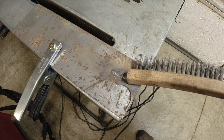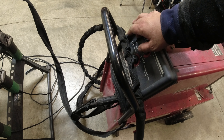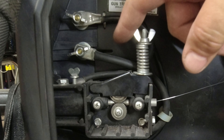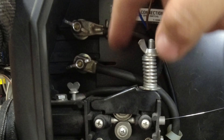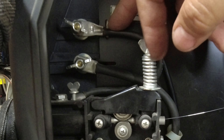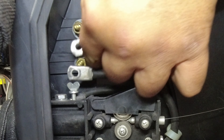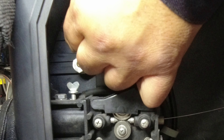The very first thing that gave it away is the sound. Now, just about every machine made to run with gas or flux core has two settings: electrode negative and electrode positive. It's currently set up for the gun being electrode positive, which is correct if you're running MIG with gas. But for flux core it needs to be switched — you should be running electrode negative. On this Lincoln, they've put a plus and a minus right there for you.